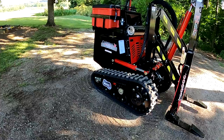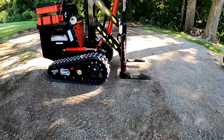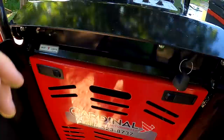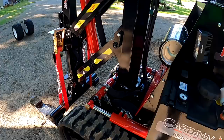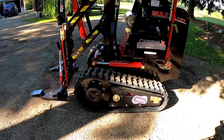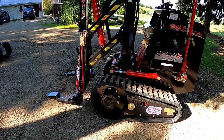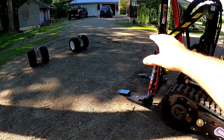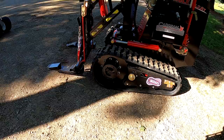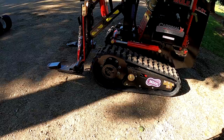Most bigger buildings are heavy enough that they just sit down on the forks. We call it float — it's all hydraulic. We can set the forks to float so the hydraulic is loose and not controlled by the pump. What that allows us to do is go over the edge of a hill, over bumps, all kinds of stuff. The fork and boom in the front stay with the building, so the building might be flat while the mule is at an angle going over a hill — it just floats along. That really helps getting through mud, hills, all kinds of stuff. With the whips, mud and anything pretty much, it just goes right through.